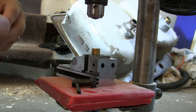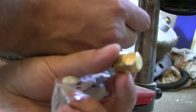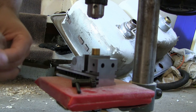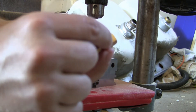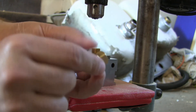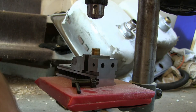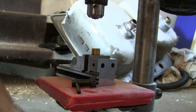I'll be making the electrode holders for my spot welder using these brass end caps because they were easily available — that's two bucks. I'm going to make the electrodes out of 10 gauge single core wire. I'll be drilling three holes: the first is a 7/16ths through hole at the base, on the side a 1/8 inch hole to put an 8-32 tap for brass knurled head screws, and on the other side a 5/16ths hole for soldering to the single gauge wire I'm using for my leads.